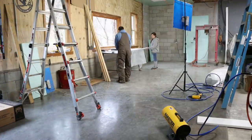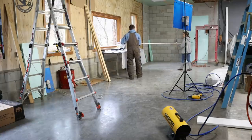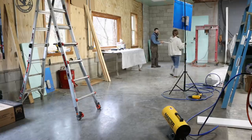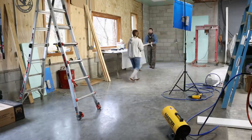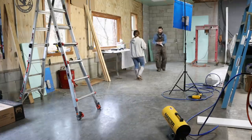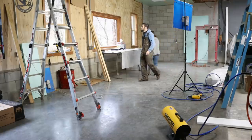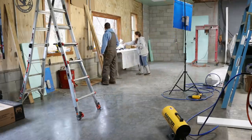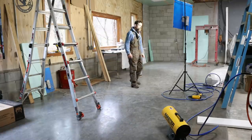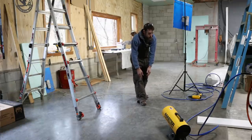Mounting the foam board to the ceiling is really easy. First I'm putting it up on the bottoms of the trusses, held in place with twelve 3-inch screws — though two alone would hold the weight of one of these sheets, they're pretty light. Then stripping all the cracks with 3-inch strips of 5/8 ply, which is what Elizabeth is helping me paint right now. It's looking really good. I'm definitely happy with the way it's turning out. This will also give it a little more weight-bearing capability in the future when I go to insulate more.